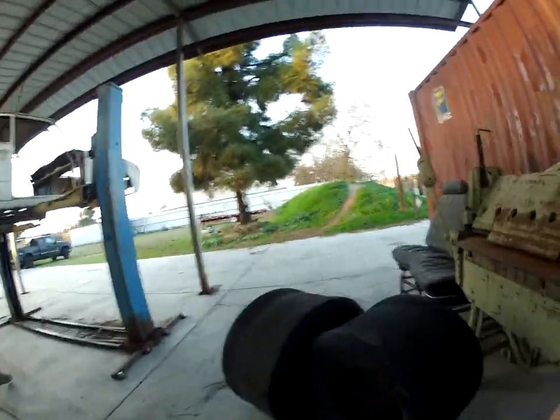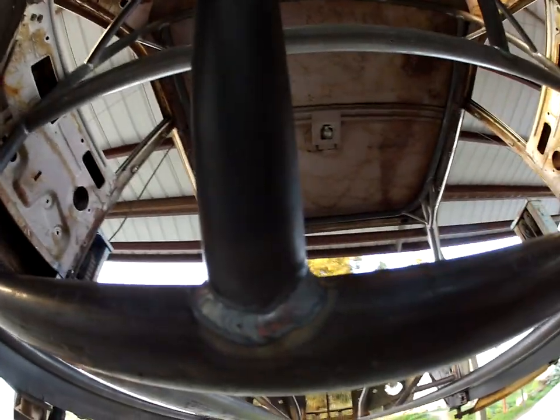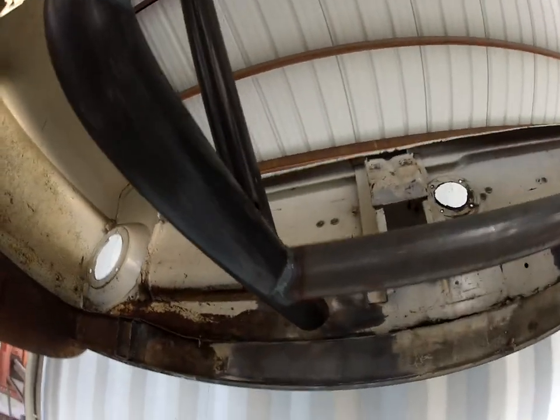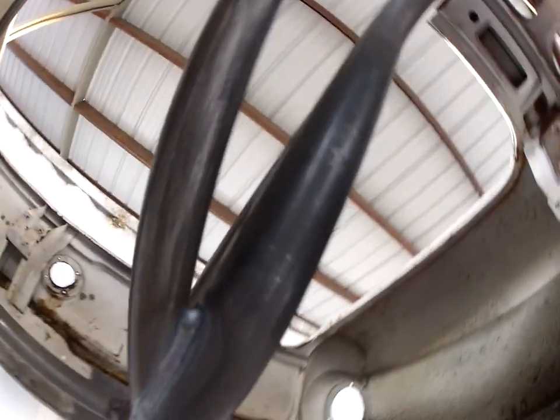I tell you what, though, getting all this figured out on that crib was a motherfucker. Good welds. They're all right, they're middle of the road. Mike's going to see this. He'll think I'm the worst. I'll tell you right now, he'll do a better weld, I won't argue that. Those are good. They're burning too much, but they'll still pass. They'll hold. They're still rainbowy, but they're burning too hot. I should have had a gas lens. Ironically, a smaller tungsten made it worse.